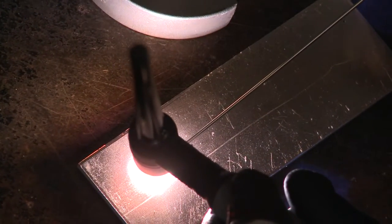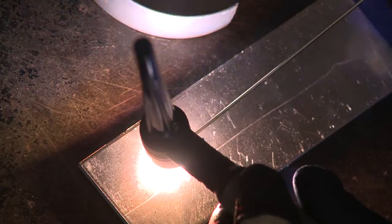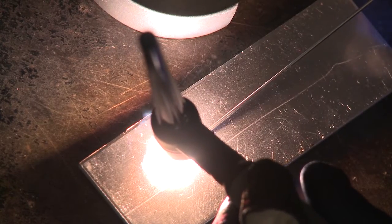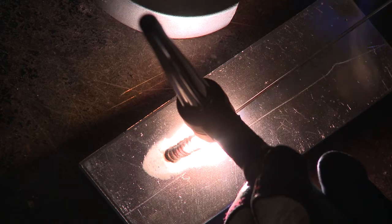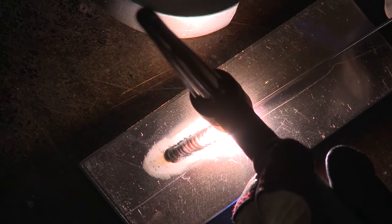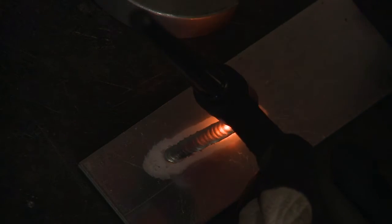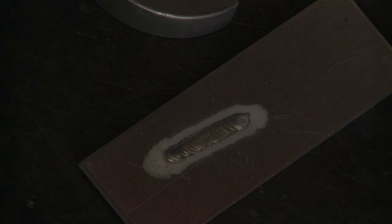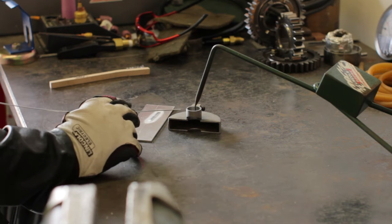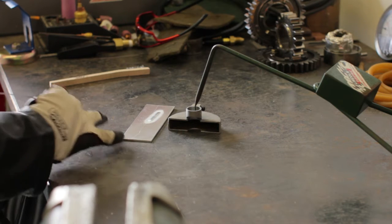Okay, I've got it set on some pretty major cleaning. You can actually see that cleaning — it's really attacking the oxides. All right, now I've got the right temperature, right amps. And you can see the cleaning action that's taking place right here is much more than normal. The only reason I set it for that is because the part that I have is going to be a very dirty part. It's typically got a lot of oxides in it, oil residue.